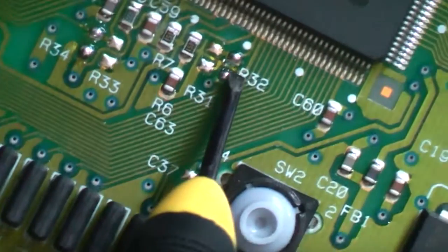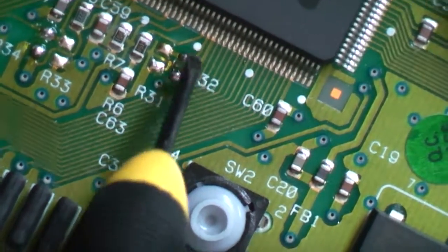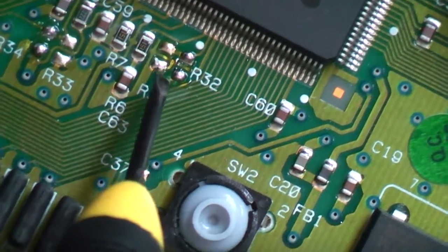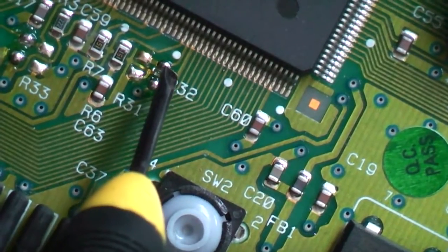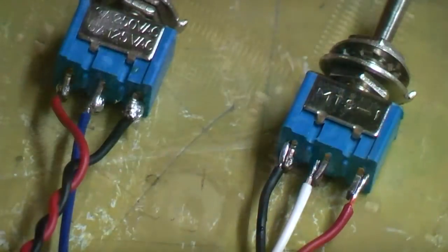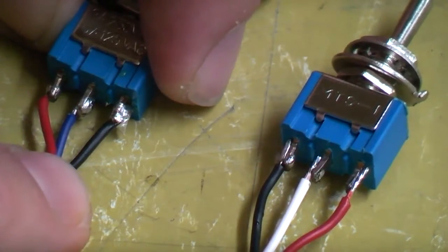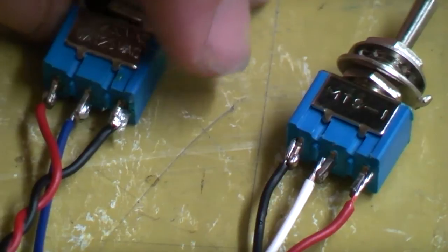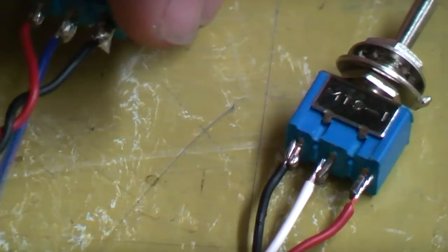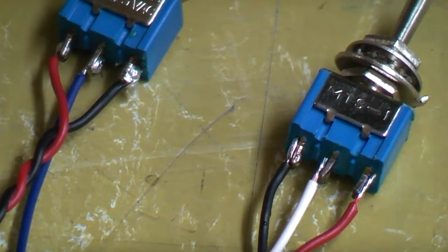Just looking at our English and Japanese switching here — it's the same thing. The top two points are actually joined up and you can see they go straight up into the Sega chip. The chip is expecting to get five volts or ground to let it know whether it's English or Japanese. We're going to add our red and black wires down the bottom and a blue wire up the top that's going to go into the centre of our switch. These are just single pole double throw switches — SPDT if you're searching for them online. The blue wire will be for our language switch and the white wire for 50 and 60 hertz switching.